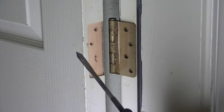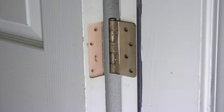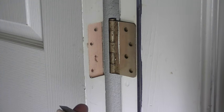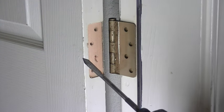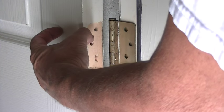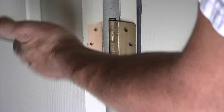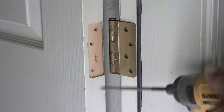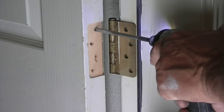So what you're going to want to do is get a 5/16 inch drill bit. If it's a solid door all the way through, you're going to want to mark on your drill bit how deep you need to drill for these dowels so you don't drill in too far. This one is only solid to about here and then it has foam in between, so we're not too worried. These will go a little bit deeper than the solid piece. So we're going to drill out our first three holes — you want to make sure you drill nice and straight.